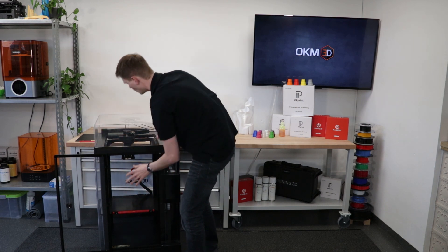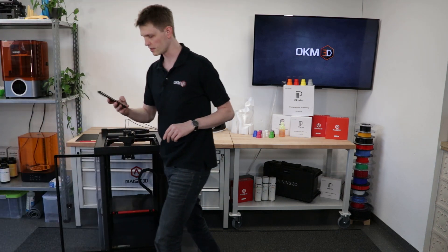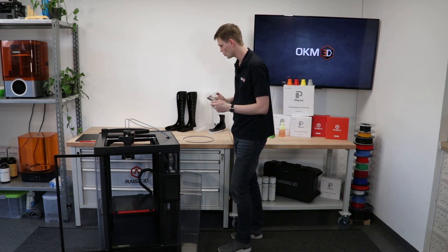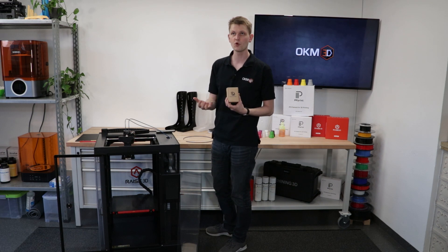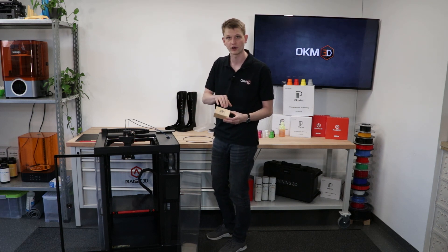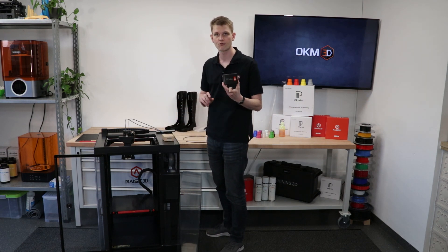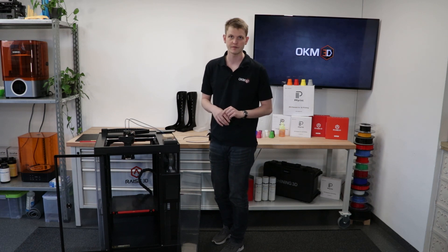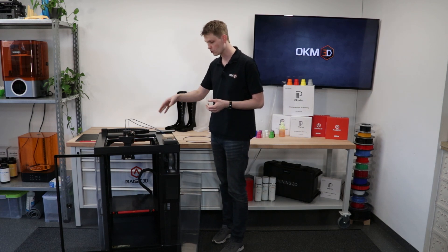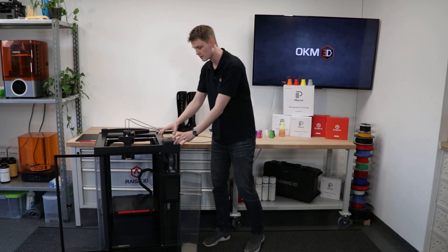On top of that, we've modified the printer in a couple of ways. We replaced the hot ends with Bondtech hot ends to improve the temperature distribution and to have a better heat break, meaning not as much warmth travels up the filament to weaken and soften it before it gets to the hot end itself. Then we added 3D Solex nozzles that have a so-called core heating technology, meaning we're able to melt down the plastic better and have a more continuous flow. An added side benefit was significantly less stringing compared to the old nozzles. We're using 0.6mm nozzles to improve print speed, and the quality is entirely sufficient for these models.